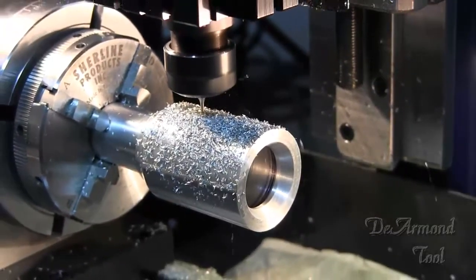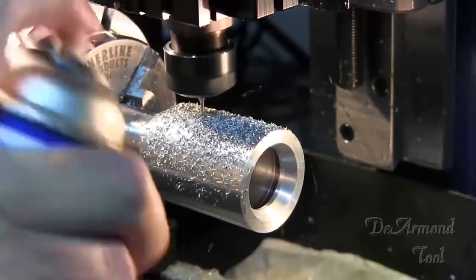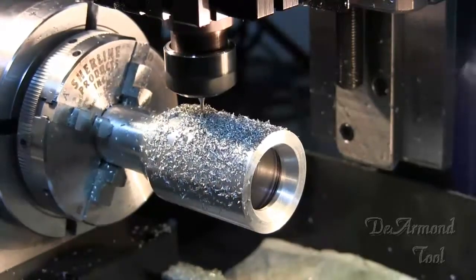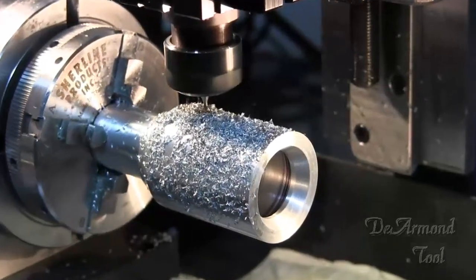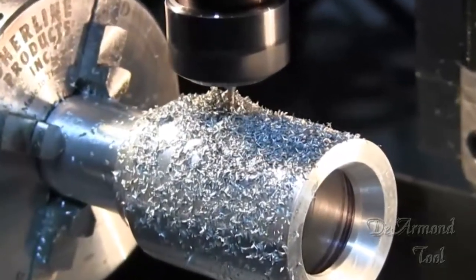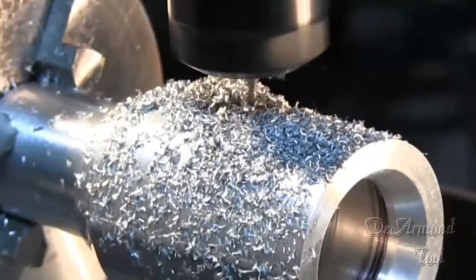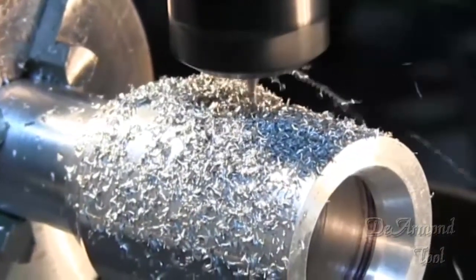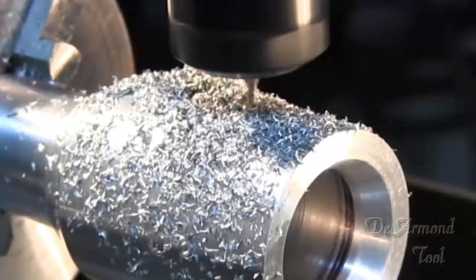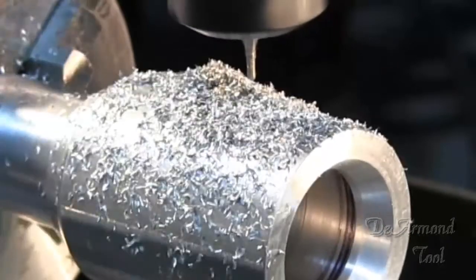Not that it'll prevent anything, but there is a reason for me pressing the limits here. I ran a test cut or two, and it was clear that a single pass at full depth of cut was going to give fewer tool marks and a bright, smooth finish in the bottom of the cut. It isn't the loss of a tool I'm concerned about here, but the loss of this part. This is one of 6 parts made for this light, and I just don't like making parts twice.